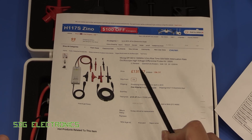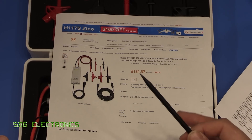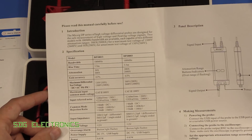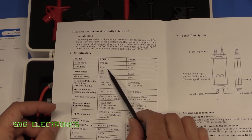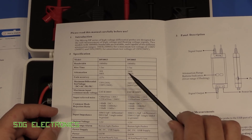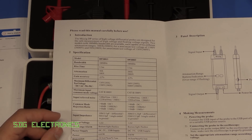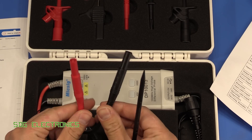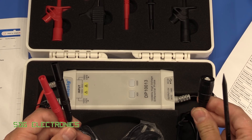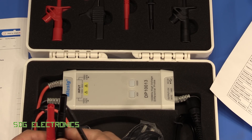I highly recommend you have a look at this device because it's actually a really good price for a differential probe. If you're doing any projects that involve mains and you want to look at it on your oscilloscope, it's well worth getting one of these. The specifications are pretty good: it's got a bandwidth of 100 megahertz and two attenuation ranges — 50x and 500x — which means you can differentially probe up to 130 volts or 1300 volts. The maximum voltage between the two probes and your oscilloscope mains earth is 1000 volts, as written on the device.